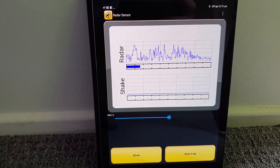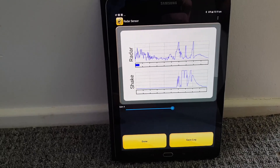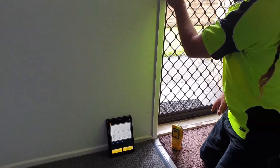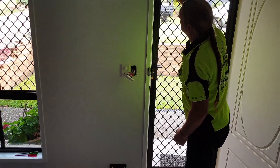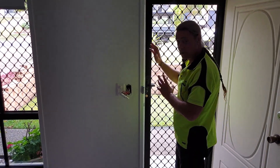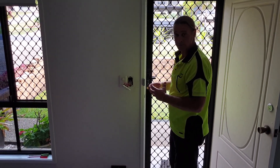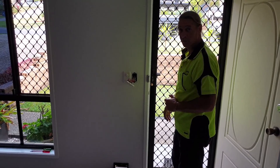Hopefully that's a brief explanation for you, and you understand exactly what we're trying to do — checking moisture areas, then checking for termite activity leading to moisture. Also a series of marks, and each of these marks are stepping stones. If we go all the way up here, I've got activity up to this point. There is another room adjacent to this entrance where we are getting quite heavy activity. What I'm going to try to do now is work out where they've entered this structure. Once I've done this process, we'll work out the best way to treat it. Until next time, have a good day everyone.